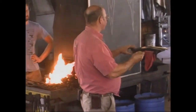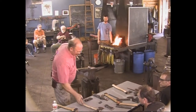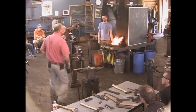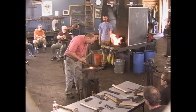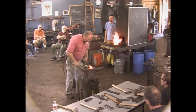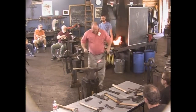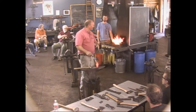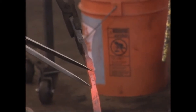It's not too hard to forge most of the blade to one side because then you can set it on the anvil and straighten it. We're just going to work this a little bit and thin it out a little more and try to make this side the same as the other side. Also keep in mind that this side's hotter — it's going to shrink just a little bit. I don't know that that's a big deal in this scale, but I've had it bite me before. I think that's still a hair smaller than the other side, so we're going to even it up.